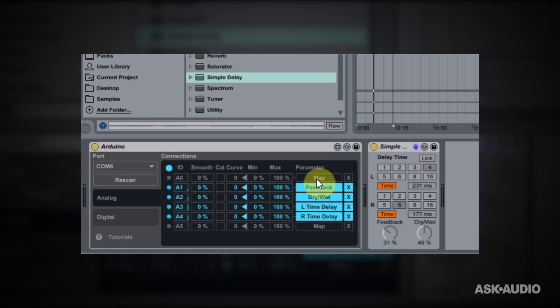Another thing we can do is map the on-off to the switch we have, although it's a little finicky because of something called bouncing — so that's going to be a whole other tutorial on how to get around that. But if we map it right now, we'll see that it's off, and if I flip the switch, now it's on. You can see there is some feedback going on, and if I pulled any parameters all the way down, sometimes it will glitch out. If you experience a flickering on and off when trying to use a switch on the on-off button, try switching the input from pin 1 to pin 3, or try another switch, or just relaunch the Arduino and try again. It will eventually work.